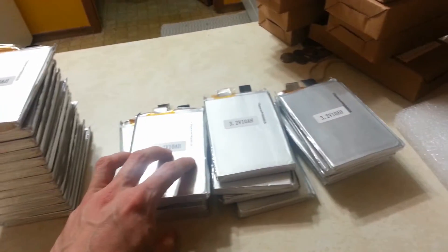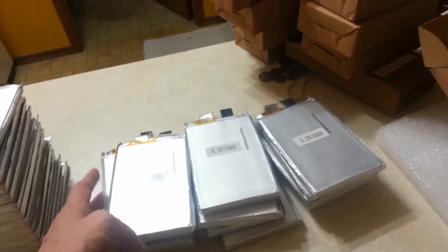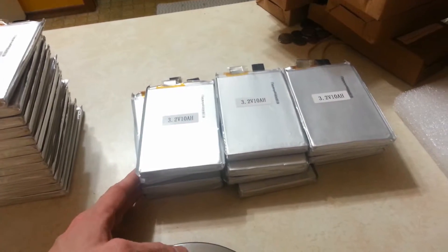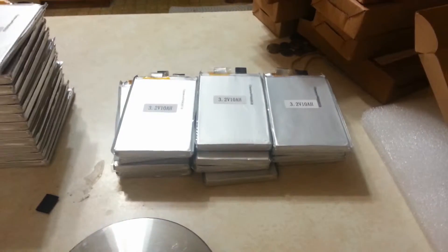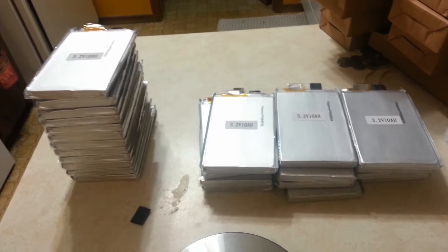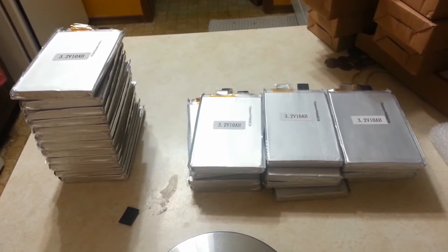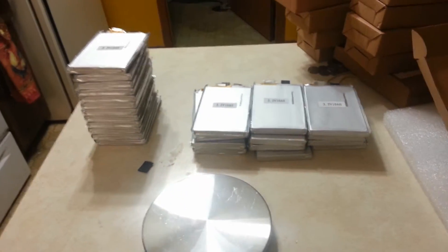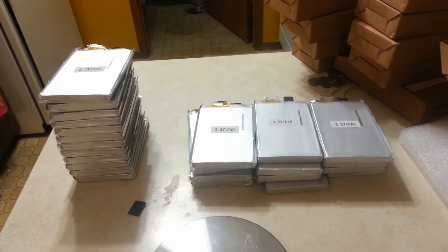So I have the equivalent just in this pack here. Imagine this is 12 volts, 12 volts, 12 volts — so that's 12 volts, 30 amp-hours. That's three-fourths of the amp-hours of a car battery at the same voltage, maybe even a little bit more. And yet it weighs a third as much, maybe less. So I've got close to two car batteries worth of power right here at a quarter of the size and a third of the weight. That's why we go with these, in addition to the power output being more consistent.